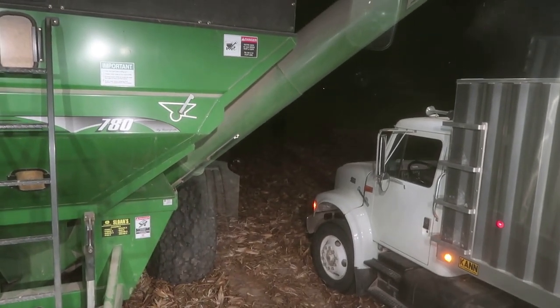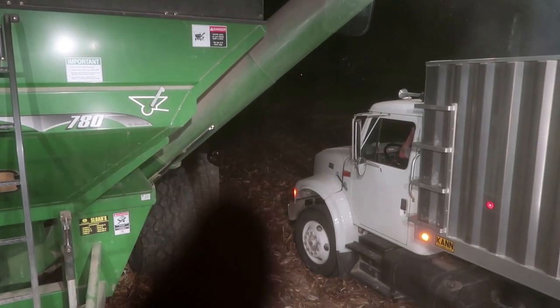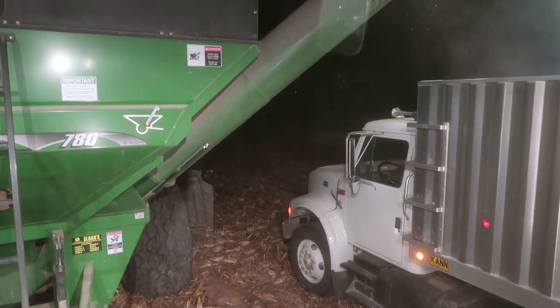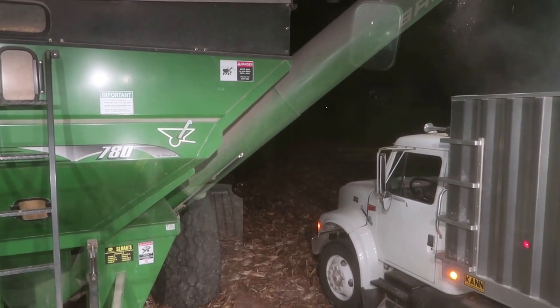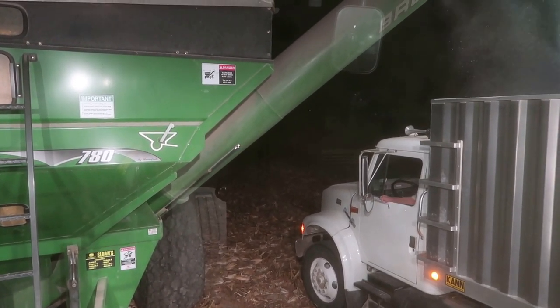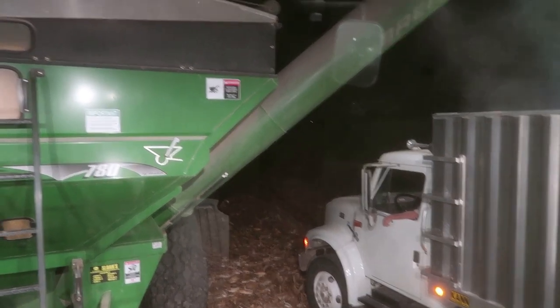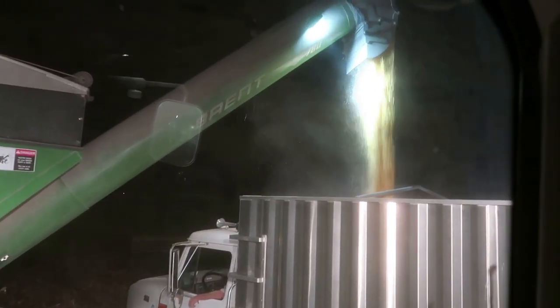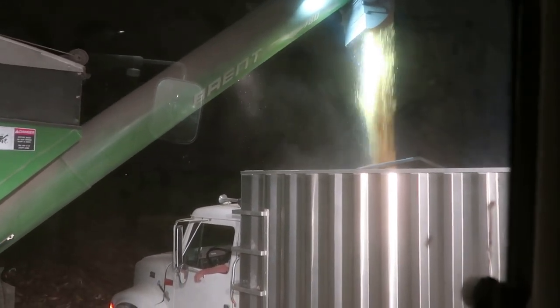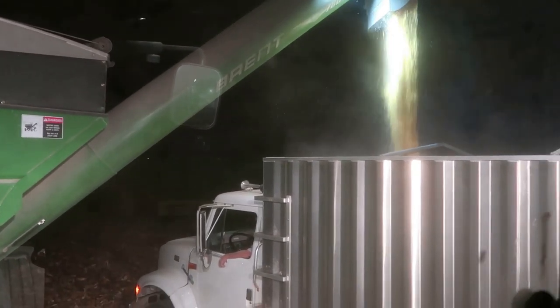See that black rod down here on the auger? Right there. That's how you control the flow of the grain here. It's hydraulic. So, see, I can open that farther and it'll spit it out faster, or I can close it down and make it go slower. These carts like this, these bastards will spit grain out in a big hurry. Of course, then I can speed the tractor up and slow it down too. That helps too. So, you can kind of regulate it two different ways, really.